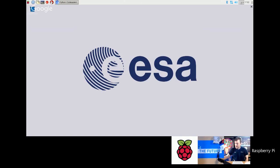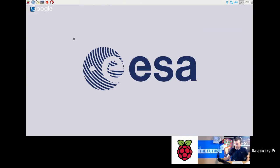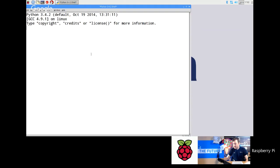So on the Raspberry Pi, the way we use Python is to use a tool called IDLE. So if you go to the start menu at the top, Programming, and then we're going to go down where it says Python 3 IDLE. Not Python 2, we're going to use Python 3. Click on that, and then this window comes up. Now I've made the font big. You probably won't have a large font on yours. I've made the font big here deliberately so that you can all read it, especially if you're having bandwidth issues or anything like that. So we're going to quickly write a little program.